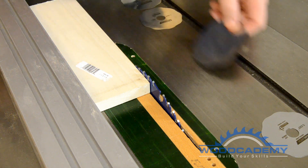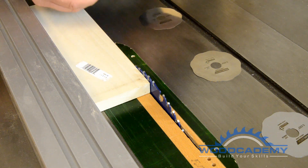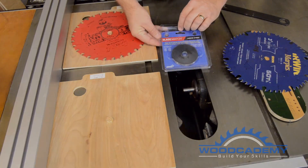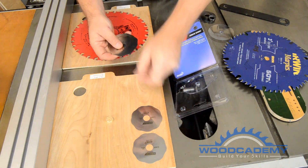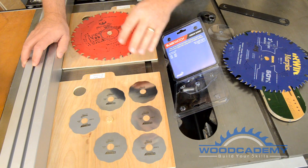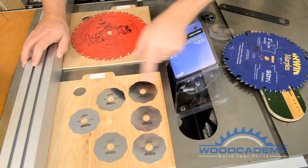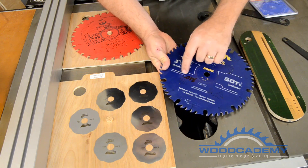I put the test piece back in place and use the arbor shims like a set of feeler gauges, stacking them in different combinations until I get the exact fit I want. You want to find a combination of shims that just barely drags between the board and the blade — they should slip between the two easily but drag just enough to hold themselves in position. In this particular case, 18 thousandths was the right setup. In the package you'll find six shims: 3, 4, 5, 6, 10, and 20 thousandths, giving a range from 3 thousandths all the way up to 45 thousandths by increments of one thousandth of an inch.